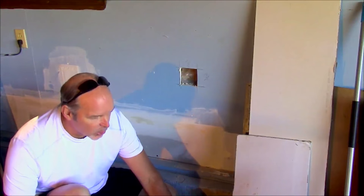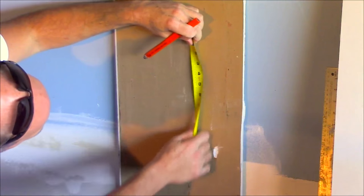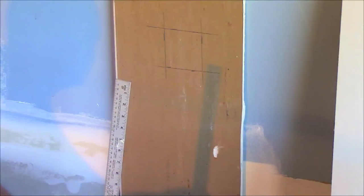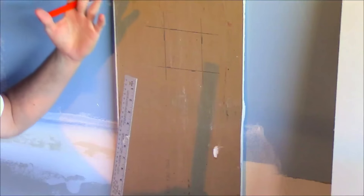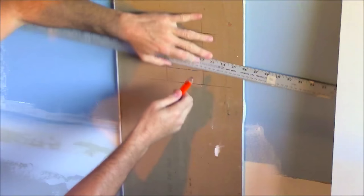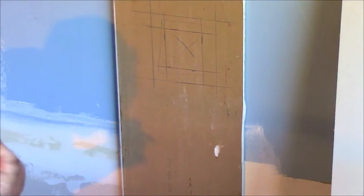I want you to cut an oversized patch. You can see there's a paper side and then just the back side. I'm going to draw my square on the back side — a three and a half inch square. Now what I'm going to do is extend that about an inch around. I'll use the opposite side of the ruler to make my border, all the way around. So this is my patch and this is my border.